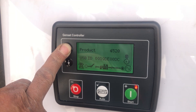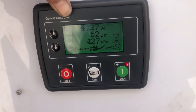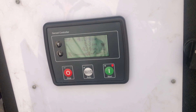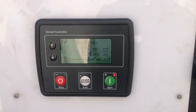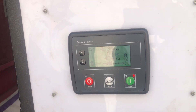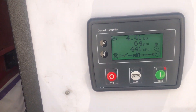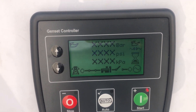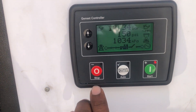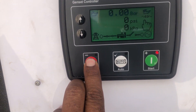To verify the oil pressure and engine temperature safeties are working, we will remove the wire from the oil pressure sender. You can see the oil pressure reads 4.34 bar or 63 psi. When you remove the wire from the oil sender, the screen will display the 'XXX' value, which means the oil sender has been disconnected. Thanks for watching the video — don't forget to subscribe and share.